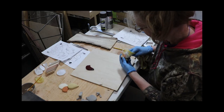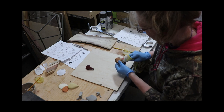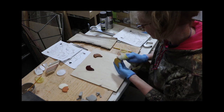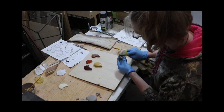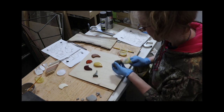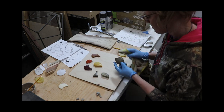Next was to coat all the pieces with Old Master's poly gel. I wipe it on all the pieces and then wipe it off until it is dry to the touch. I just loved how those colors popped — so nice! You can do as many coats as you like, but it needs to set a few hours between coats. I'm doing one coat on these and plan to put another spray poly finish on it once the pieces are all glued on the front.